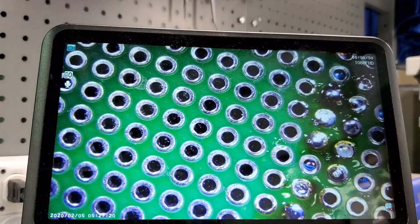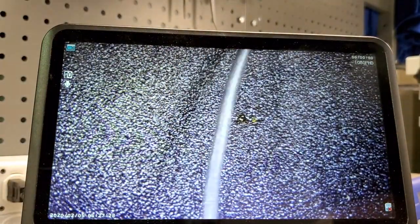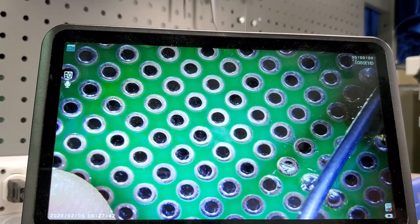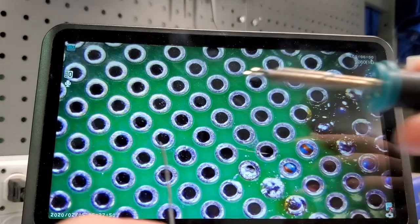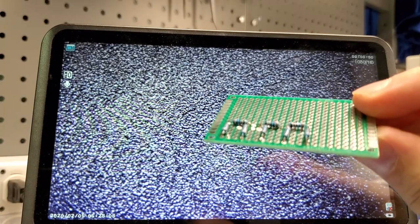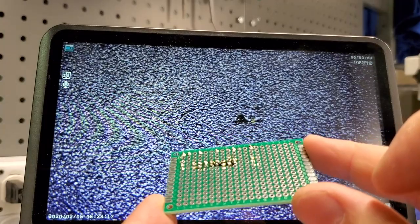Solder did get on some of those extra ones — that's okay. We're going to go ahead and try to create some solder bridges right here. Actually, this is such a good flux-core solder that it's not forming solder bridges — it's got a little too much flux in it. From the top view, they're all looking pretty good, with hardly any seepage through to the front side, which is exactly what you want. You want a little cone on both sides, and on the back they're all little cones. That is through-hole components done.